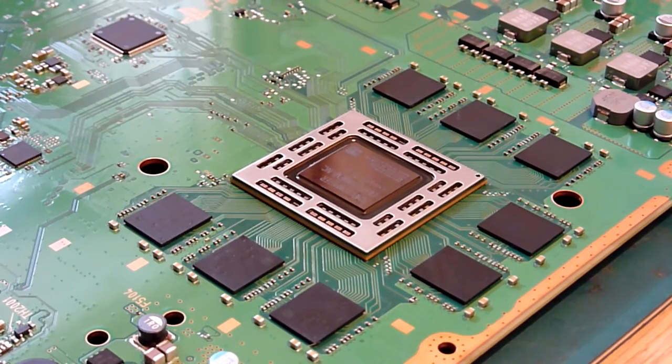Again, just make sure you remove it, because ultimately you want to make sure that this board is as close to factory as it was when you started, because of course the closer you can get it back to factory, the better your results are going to be. Some fluxes can be corrosive to traces, and motherboard copper and layers and things like that, so it is important that you remove it as much as you can.